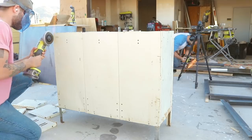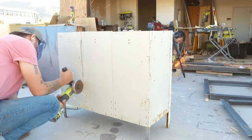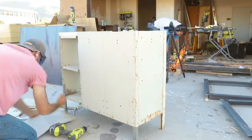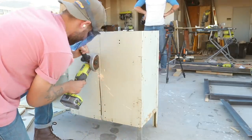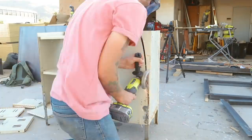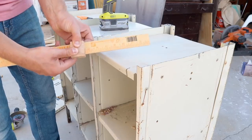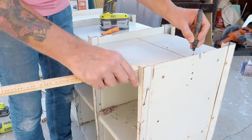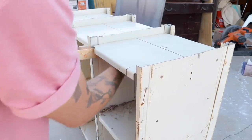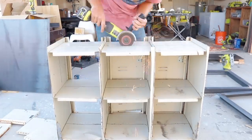I'm going to have to remove a lot of material from the back of the lockers so that I have room to make a compartment for the TV lift as well as the TV to be stored. The first thing I did was remove the back panel of sheet metal. The cabinet is going to have a wooden back that the lift is mounted to, plus this gives me a better vantage point to start cutting the shelves in half. I hot glued a piece of wood to a ruler to make a quick reference line on almost every face of the cabinet.